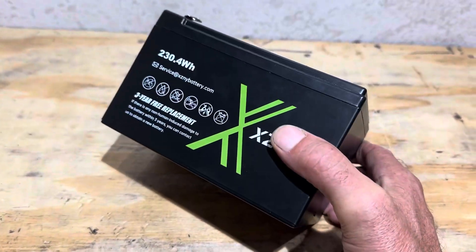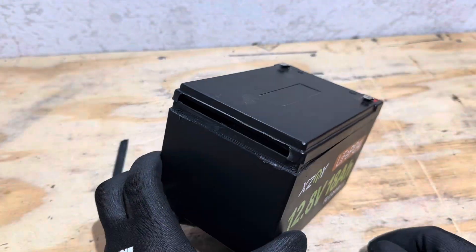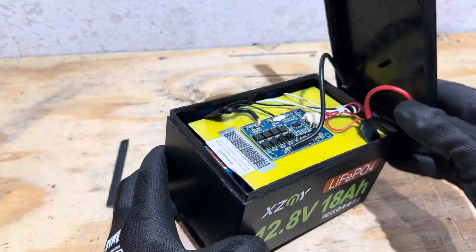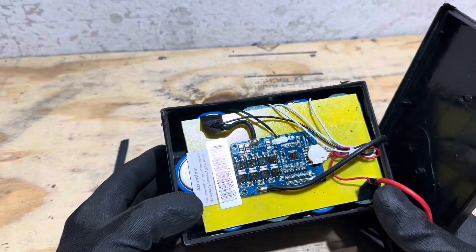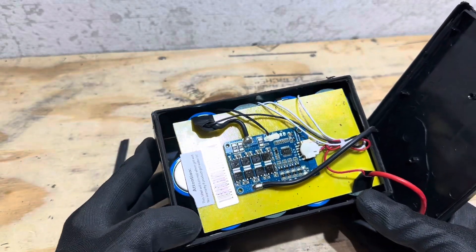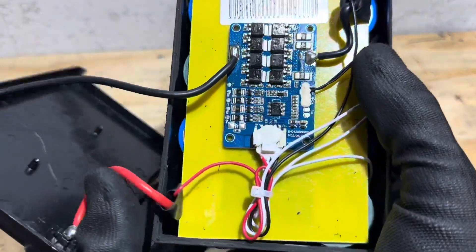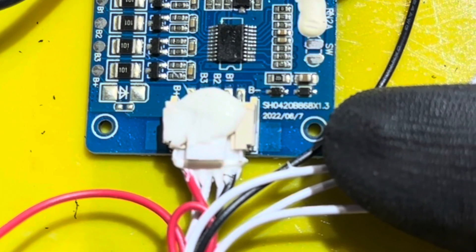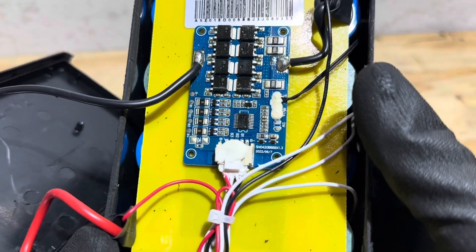All right, now I'll crack the lid on it — a little quick tear down on this little mini battery and see what we've got going on. So I got the lid cracked loose — once it went, it kind of went. Anyways, what do we got in this battery? We've got cylindrical cells in this battery. And that looks like a Cyhang BMS. Let me get around here and see what the numbers are on this. It's a SH0420 Cyhang — so that would be a 4S 20 amp BMS from Cyhang.